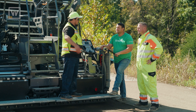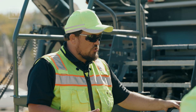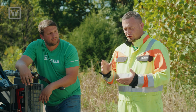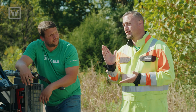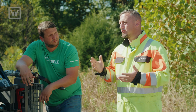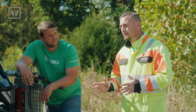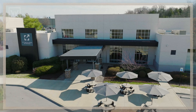The training center is where I'd make mistakes, right? That's right, it's a great place. Do you have any questions? Yeah — I use screed assist for the traction control issue and now for a half pass. When else would I use screed assist? Great question. You use screed assist for traction control starting at 0% and increase it until you resolve the issue. On this half pass we started at a hard number, 50%, with all the oil on the unconfined edge. You could use screed assist with poor load-bearing capacity and in radiuses — most of those situations you start at zero and increase until the problem goes away. You need to use it, learn how the machine reacts to the material, and have fun with it. The CTT is a great place to be.